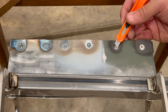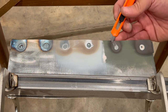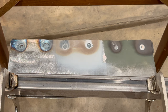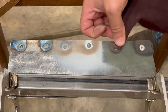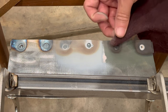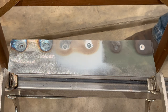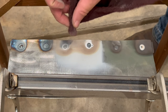Kind of similar. This inner white part on the self-etch is all burned away. And then a similar residue. Interesting. I'll tell you what, let me just do a little bit of Scotch-Brite instead of something so aggressive. Yeah, look at that. So that inner, I guess, second ring of dark there, I was barely putting any pressure on that, and it came right down to bare metal. So I'm guessing that lost adhesion all around that, my thumb width area. Whereas here on the weld through, it's coming up, but I'm having to work at it.